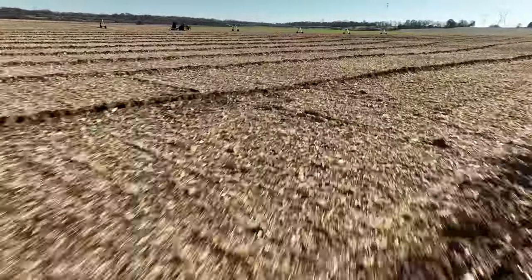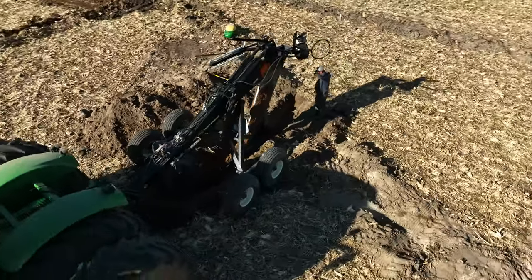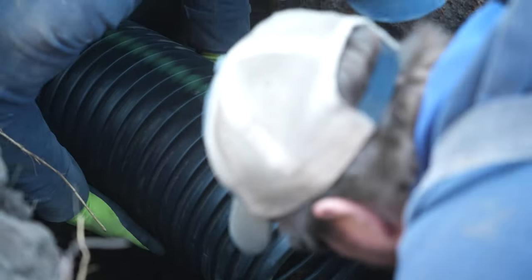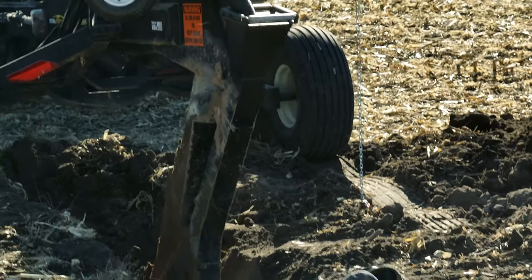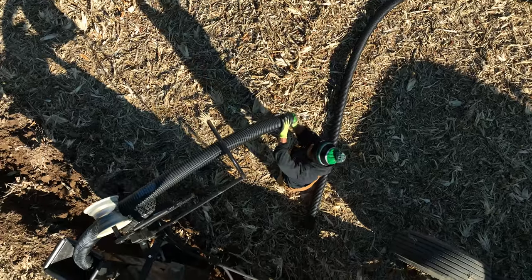This process requires an outlet at a water source. We use the GPS in survey mode, survey from the ditch or pond at a low point in the field, then install that as our main — usually larger pipes, six or eight inch. After we install the main, the guys — Aiden, Victor, Brian — dig down and find that main. From there, we use a tap tee and drill a hole in the side of that eight-inch and connect a smaller four-inch tile line to it. Aiden drives my tile cart, strings it out along the path, and the plow feeder pulls it into the plow and underground. When we get to the end, Aiden cuts it and puts a cap in, and we move on to the next one.